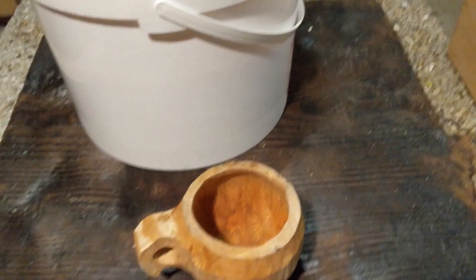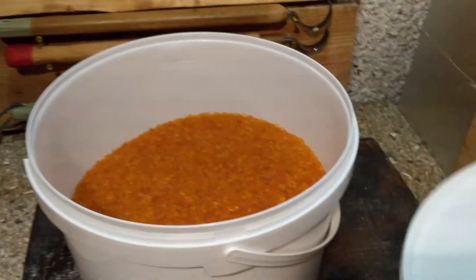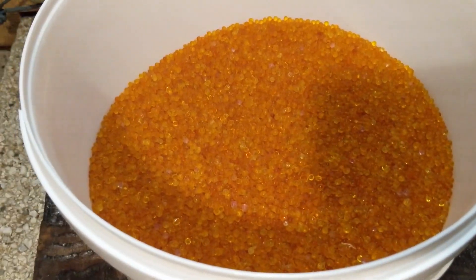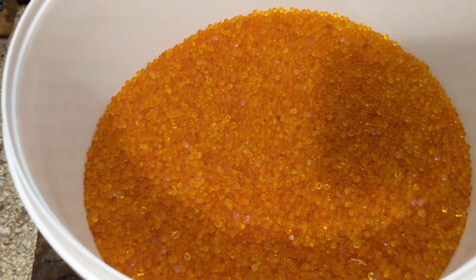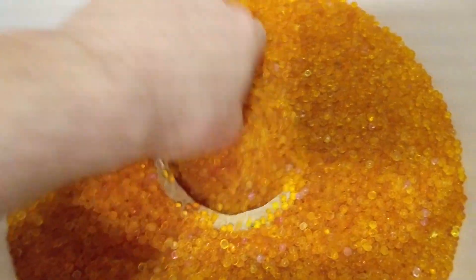This must be the most simple kiln in the world to use — you literally get the cup, take the lid off and put it in. You can see that the beads are orange because they've got a dye in, which shows that they're still dry. When the cup puts out its moisture into the beads they change colour to a bluey green colour, showing that moisture has left. So you just put it in, get it right down there, make sure every part's covered — that's it. The lid goes back on.